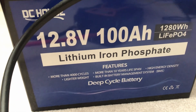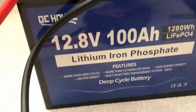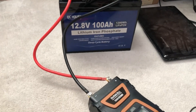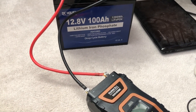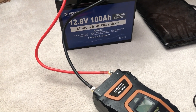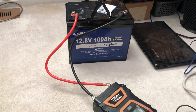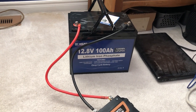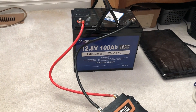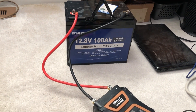This is almost a brand new battery — it only has two or three cycles through it — so this will probably be the most it will ever pull. But I'm quite impressed that it definitely pulled over what it was rated for at brand new. I pulled roughly 1,420 watt hours out of it over a three-day period running my laptops, averaging about 66 watts. There were a couple times it spiked higher and a few times a bit lower, so I'm pretty pleased with those results.